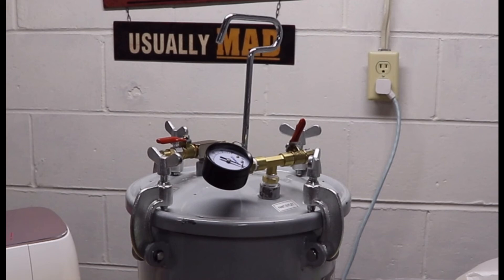There you have it — that is basically what we did. The air valve connects to the coupler on the incoming side, you can shut that valve on and off, it also has the pressure blow-off valve. On the other side you can see how much pressure you've got in your tank, and you have an additional valve to shut everything off. You can leave the compressor connected while letting the air out to bring it down, then close it off to bring it back up. Pretty straightforward setup to convert a tank into a pressure tank.